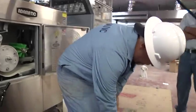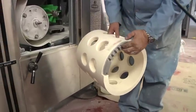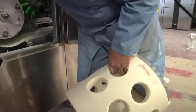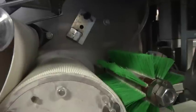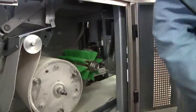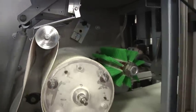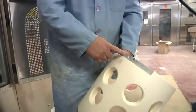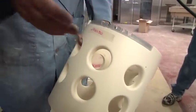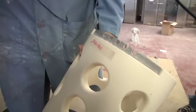To put it back together, the drum has five notches in it. There's a pin on the back plate — a post that the drum fits into — and that's your timing. It ensures that when the piece falls off the dividing head it hits the hole. Until you make your real dough you don't know which notch you'll use, so you might have to try it and see. But once you find which notch it is, it'll always be that same one. You can't determine which one until you have your final product.